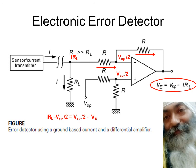This differential amplifier circuit has no limitation regarding grounding — there is no ground loop issue. You can use a grounded transmitter circuit or grounded power supplies as per your convenience. This is the circuit mostly used in all the controllers we have seen. It has a built-in error detector, and this error will be used for on-off control, proportional control, PI control, or PID control — acted upon by these different algorithms.